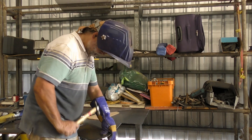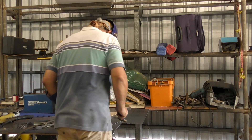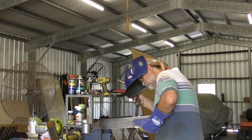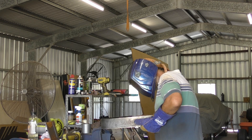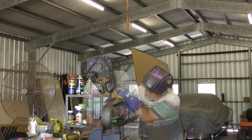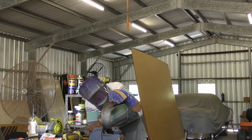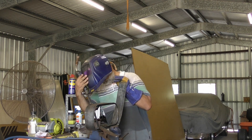I've actually manufactured four of these box frames because I've got two cabin port lights each side of the cabin, so the process was to make these rings up first. The outer strips of steel that I cut to make the outside wall of the box frame — I just marked a line all the way down 15mm from the edge, then clamped the inner ring in the vice and slowly bent the plate around using that 15mm mark as a guide, putting tack welds as I gently pulled the outer part of the frame around.